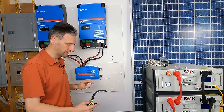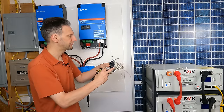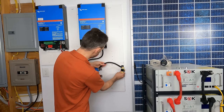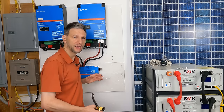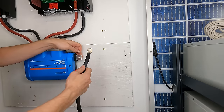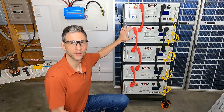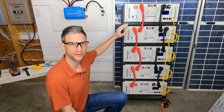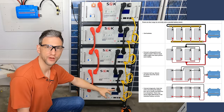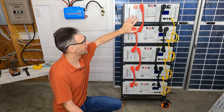Before I connect power up to the distributor, I'm going to insert this smart shunt — this is a Victron BMV 712 smart battery monitor, the one with the display. I just mounted the display in a little piece of polycarbonate for easy reference, and I've created a short piece of 1-aught cable to connect to the negative battery terminal so I can mount my shunt conveniently on the wall. To connect it up, I'll use some 1-inch long 5/16 inch stainless steel bolts and nuts with washers and lock washers to tighten it up. There's a couple different ways to hook up the battery pack, but whichever way you choose, you need to make sure that you're applying a load in a balanced way so that the batteries charge evenly.